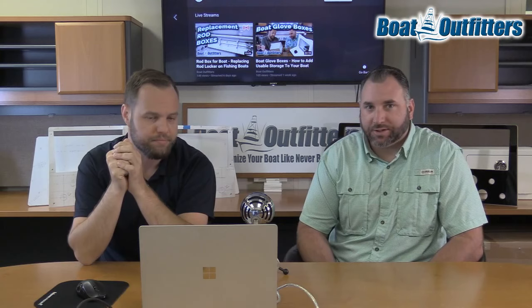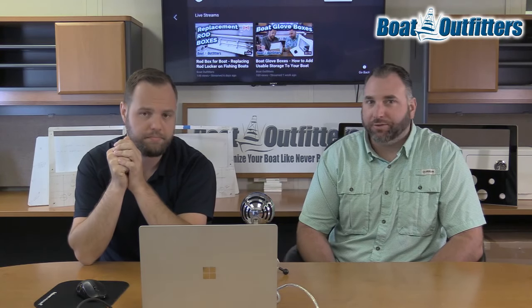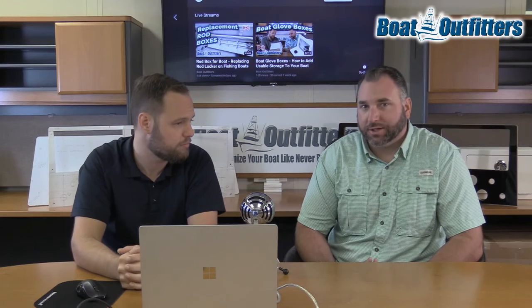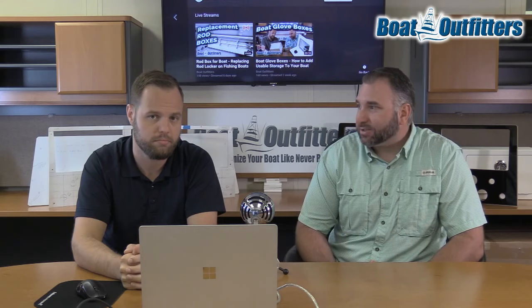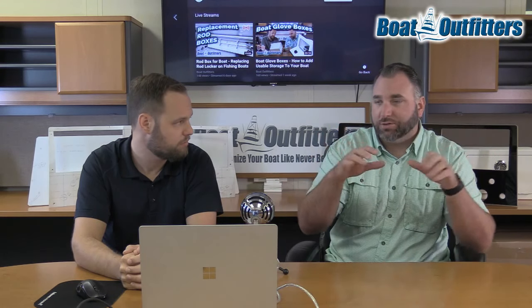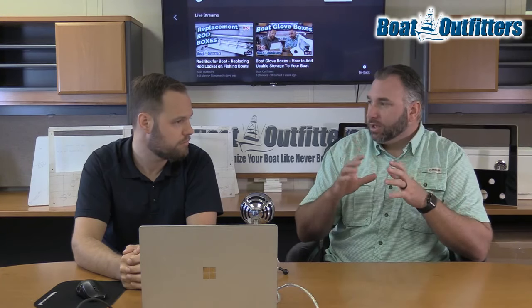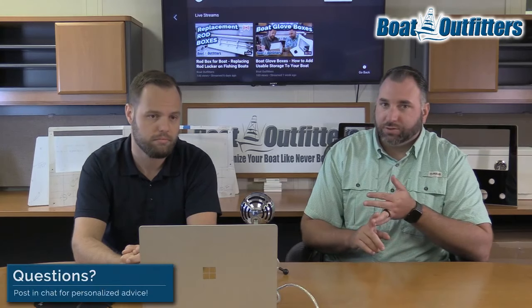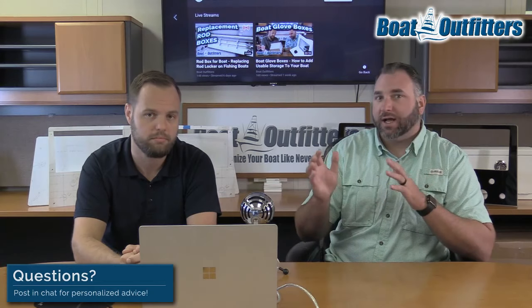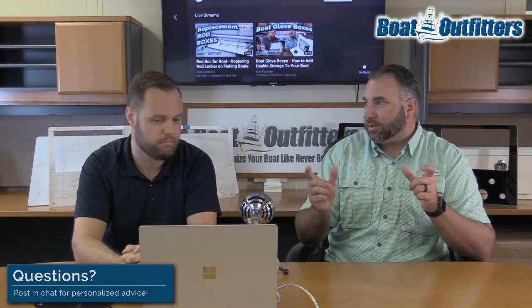We do it for the OEMs every single day. From a design standpoint, we've got 15 to 20 engineers on the other side of this wall who are able to give advice and do it stylistically and aesthetically pleasing for the OEMs. We can say, look, you've got the switches, you have this autopilot here, and you want two navigation units put in — and we're able to say it's going to be best if you move this over two inches. We can do research or already have research done on the size of cutouts and space them out to give you the best layout.